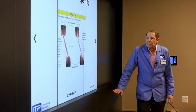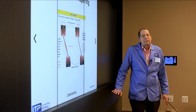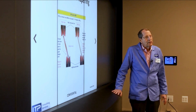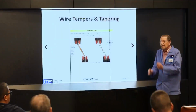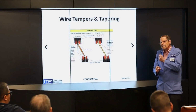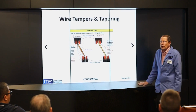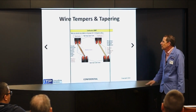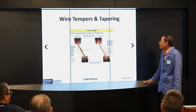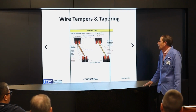In theory, a softer wire can cut slightly faster. We've tested it. But it's only like a percent or two because it has more give to it. So if you temporarily overload the wire in a cut, it's less likely to snap because it's got a little give. But again, it's more noise in most operations. You're not going to see it. So you want to go with hard wire. And soft wire won't auto-thread in many machines, and neither will half hard wire.